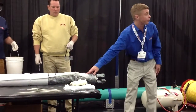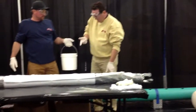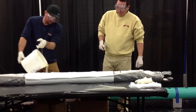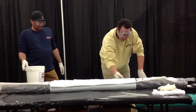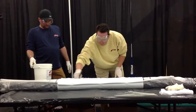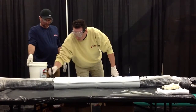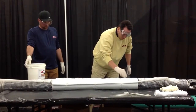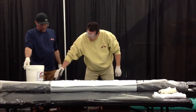The first material we place over this packer is what we call our carrier protector or packer protector. This is a nylon-reinforced, PU-coated material that only expands to a fixed diameter. This is really important because these are multi-sized bladders. The multi-sized bladder can overexpand, and if we were just to use our wrap material and you've got vitrified clay pipe with washout behind it, as it overexpands we can actually blow that pipe apart. This also serves as a barrier layer between our resin and our porous packer.